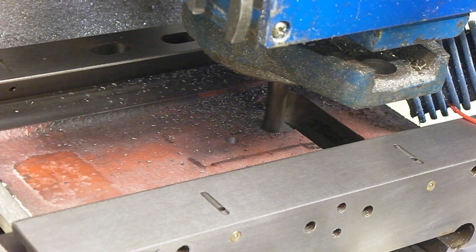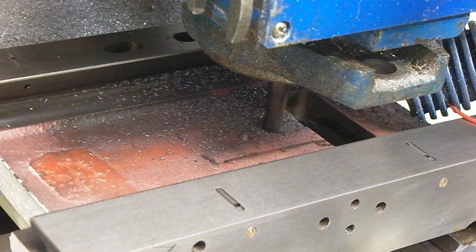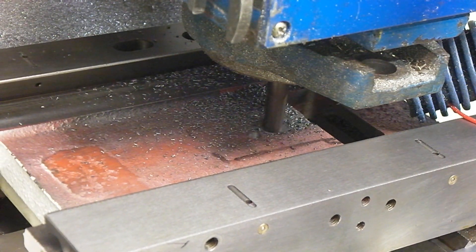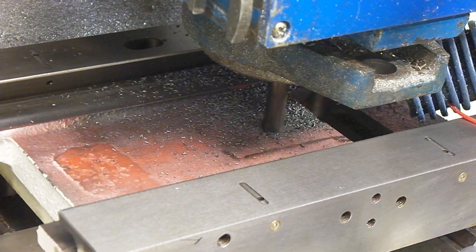When I do cast iron I don't use any lubricant — I'm not sure if you really should. This is a carbide 4 flute so it really won't have any trouble. They're doing two passes, 70 thousandths each pass.